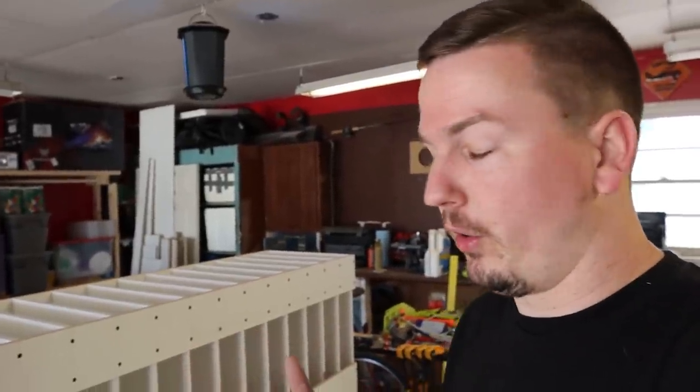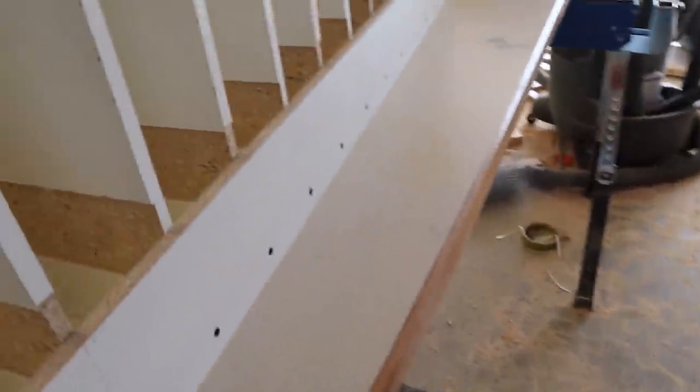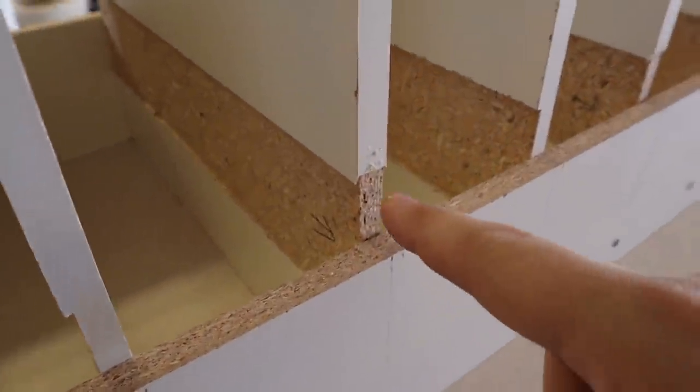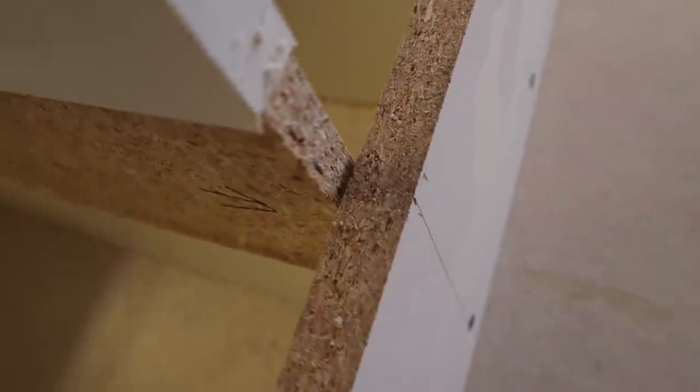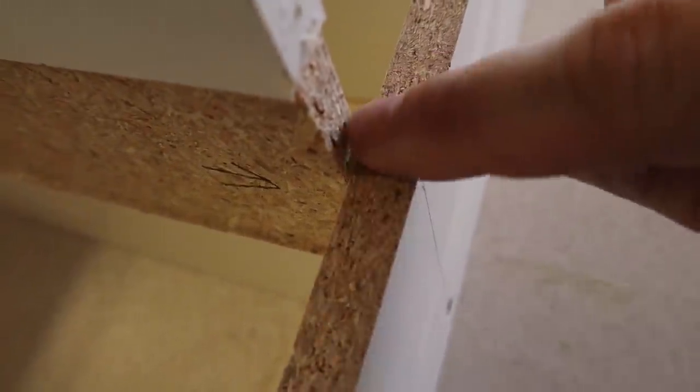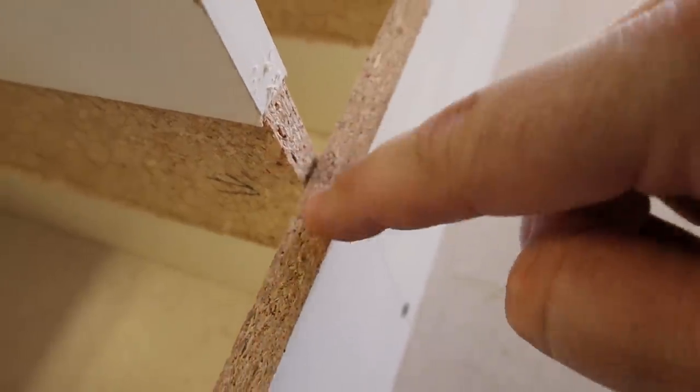And, oh, something else I didn't film, a step that I forgot to show you, and I actually forgot to do until I started putting the shelves in. You gotta remember, after you route the shelves out, I'll show you over here. You gotta remember on every one, to go left and right so that you can snake it down through there, you gotta cut the little groove in it, right here, so that the heat tape fits under, between here and the wall.